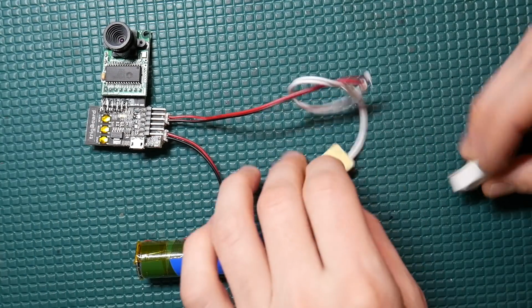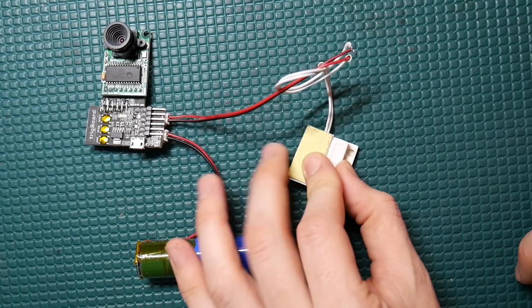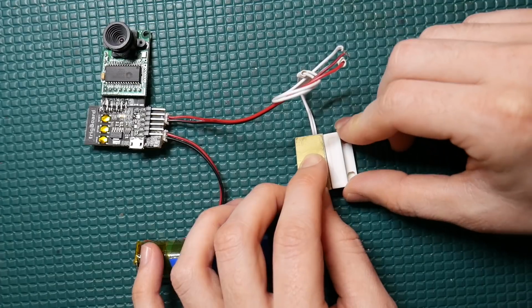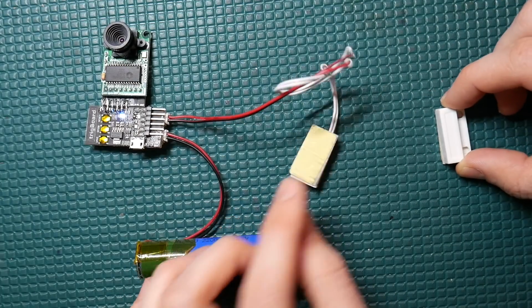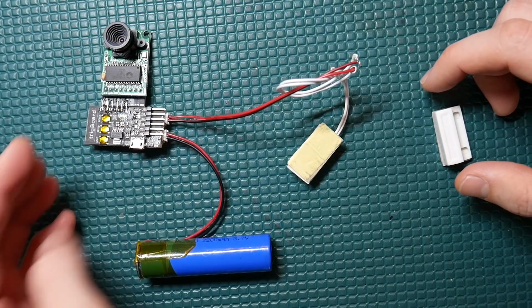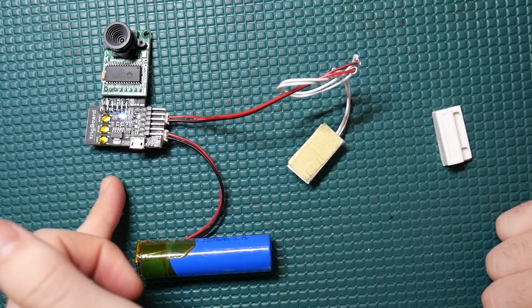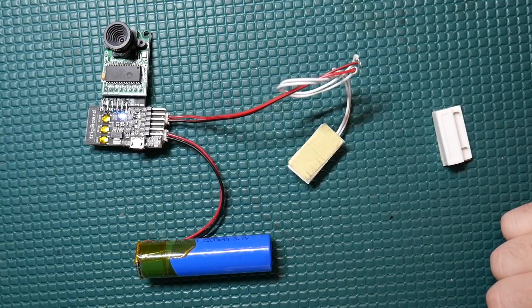And let's say that we open the door. This is just a standard, normally closed style door switch. I'm going to open the door. You see the board woke up. It just took a picture. And now it's going to upload that picture to a server and then post the link to where that picture is in a Slack channel.